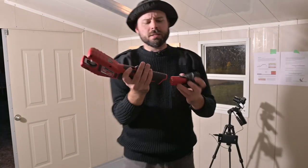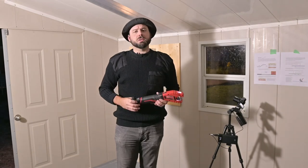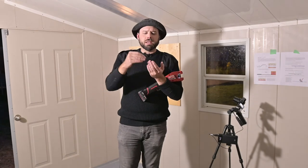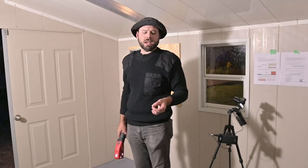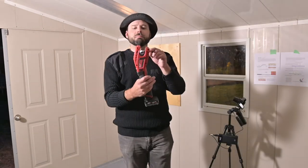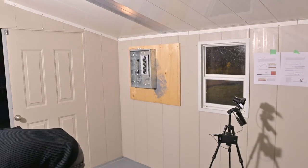I got a secret weapon — this guy right here, one of those Milwaukee pipe cutters. It's designed specifically for copper pipe, but I've modified it to cut EMT. These things won't cut EMT at all stock. It has to do with how their gear and pull system lines up with the copper pipe. Half inch copper pipe is a slightly different diameter than half inch EMT. I wanted it to cut EMT and I got it cutting EMT. The only problem is if I run this thing without a piece of pipe in it, the mechanism jams up so badly I've got to take it apart to unjam it.